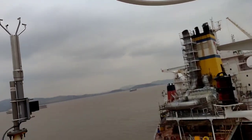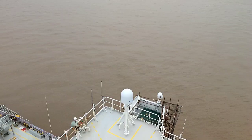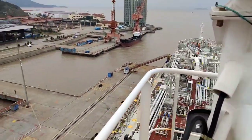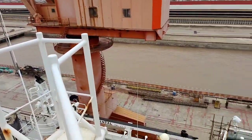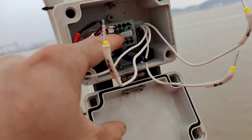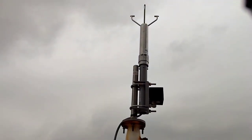We need to check the connection for our anemometer. This is our anemometer. We need to open the terminal box. The other thing we need to do is remove the toxic — the heavy cover. Then check all wires to see if there is a broken wire that touches the ground.